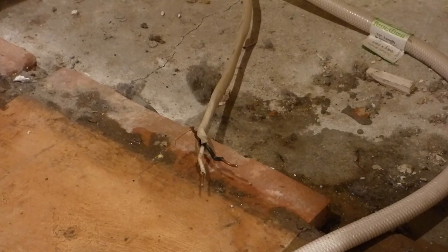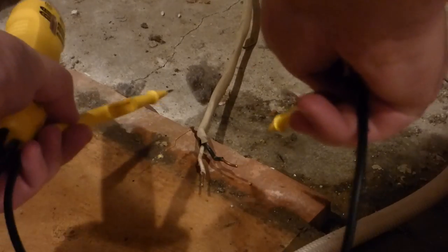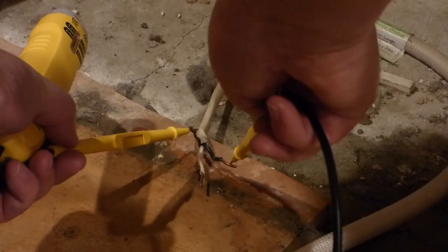And for that I will find a tester. And yes, this is a little bit late in the game to be testing it now. But like I said, the circuit breaker should be off. Negative, positive — got it. Coming in. Nope. And nope. Good. That's all dead.